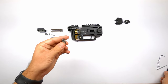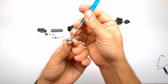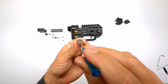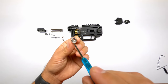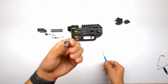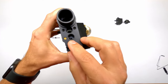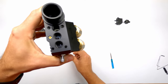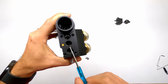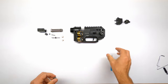Something very important to note: when you look down into this thing there is a small slot right here. This small slot allows you to have access with a flathead screwdriver to get into that slot and orient the valve housing into your valve block, so the opening exactly matches your barrel port. If you look down into that hole, you can see this piece sitting right there with that slot nicely in the direction of my barrel. So that is part one that gets installed into a block like this.